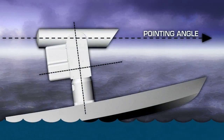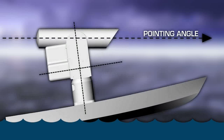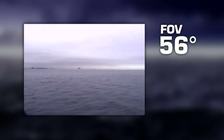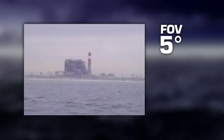The second-generation inertial stabilization module, or ISM, is fully integrated and incorporates a powerful 3-axis MEMS gyro and processor to sense motion and modify pan-tilt pointing angles in real-time to hold the commanded pointing angle and keep the target in your field of view as you are zooming in for a closer look.